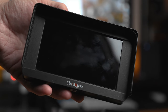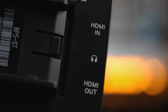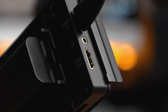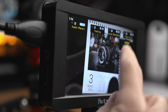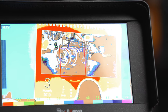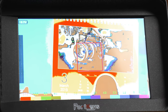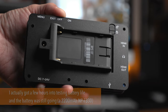The LH5T is a 5-inch camera monitor with HDMI in and out that can natively accept up to 4K 30fps signals, meaning your camera doesn't have to downscale if you don't want it to. It's also a touchscreen, which gives it a few extra tricks. It's 450 nits in brightness, with 1080 resolution and a 1000:1 contrast ratio — not a bad image overall, but not the most amazing either.